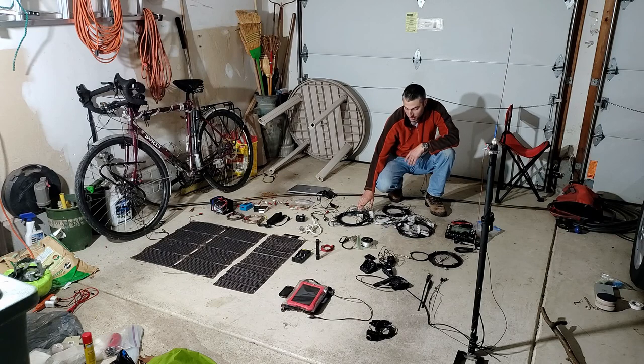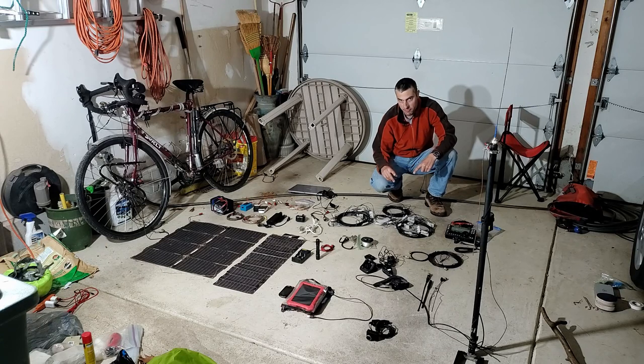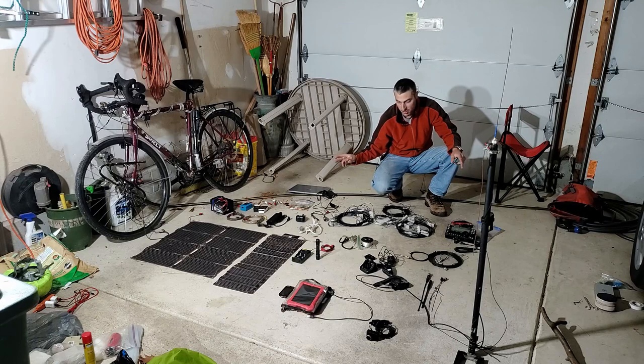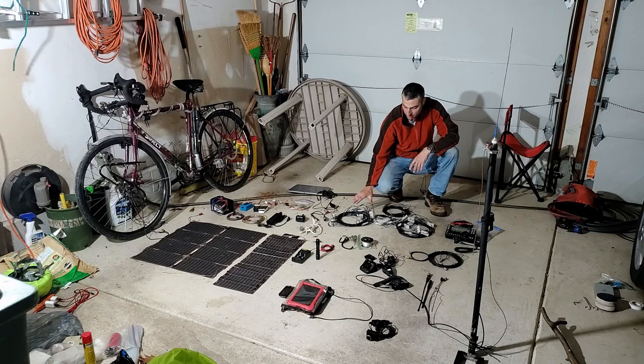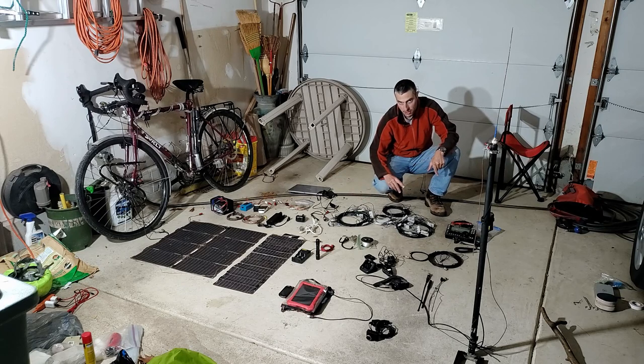The way that I built this is it's a full-size dipole on every band. So you start at 6 meters, you tune it for that, then you add 10 meters to it, 12, 15, 17, 20, and so on. But what's also a little bit different about this design is on 40 and 80, I actually split those bands in two parts. So it's resonant both on the high side for sideband, and it's also resonant on the low side for CW and digital.